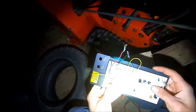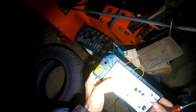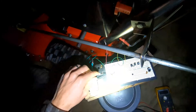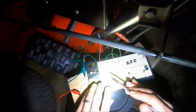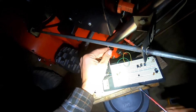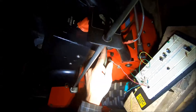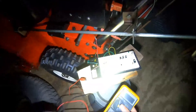I'm going to test our homemade interlock circuit here. This is the original silicon-controlled rectifier that I pulled out of the burned-up unit — or supposedly. This is a new one I bought off Mouser. This will be the power coming from the ignition; it would take this place to this one here. And then this node here will be grounded. So when this is off, it's grounded in the case.